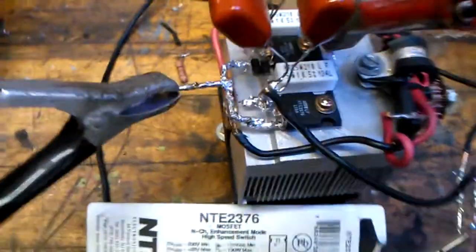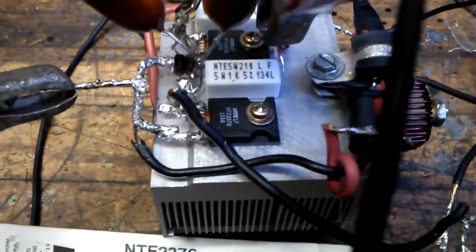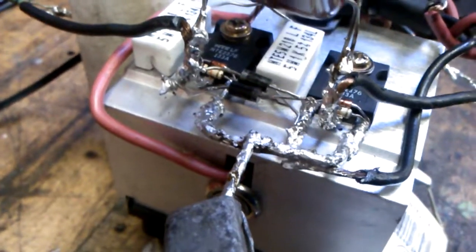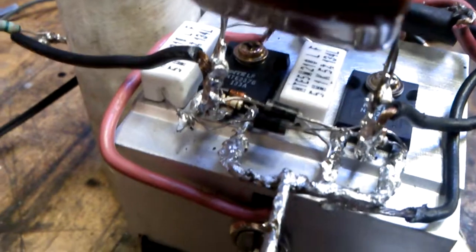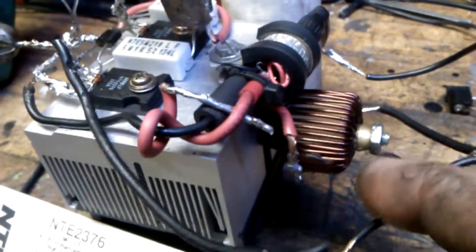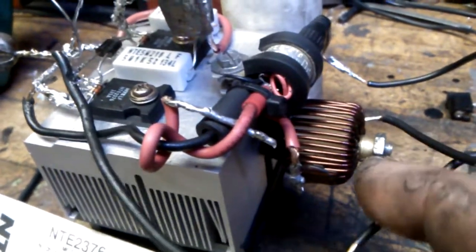Back to this — went and got some 5-watt 1k resistors for the gates. The other diodes are 600-volt fast diodes, and 15-volt zeners with a little baby 10k resistor across the zener, like it's supposed to be. The inductor I have with the nice heavy-gauge wire is mounted on there, and I believe the metal through the center of it kind of keeps the current in check.